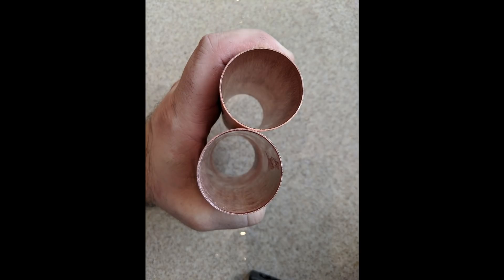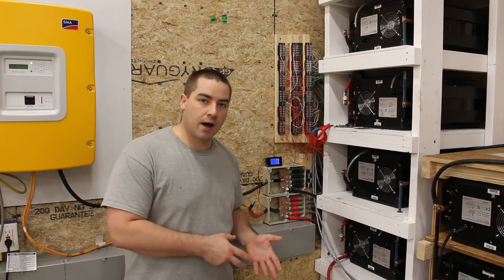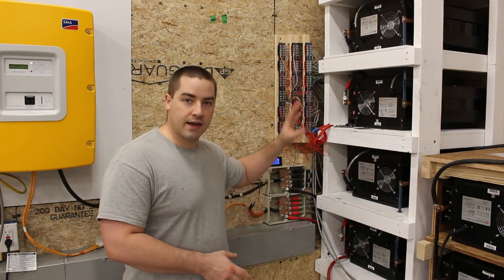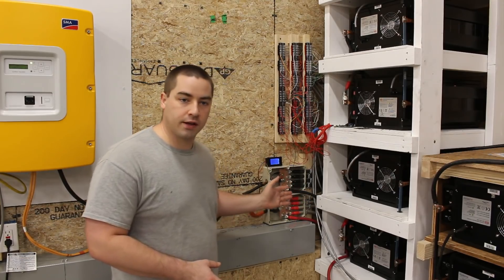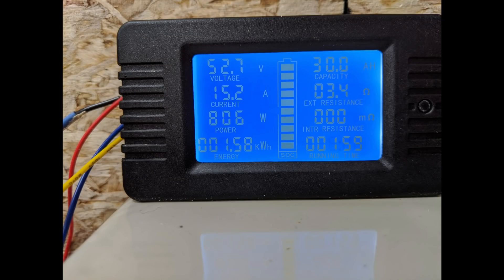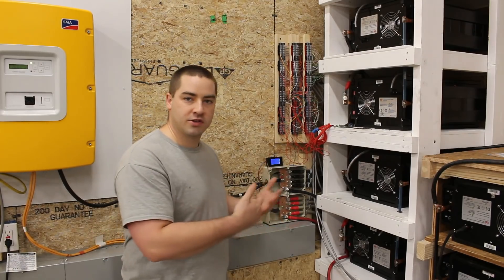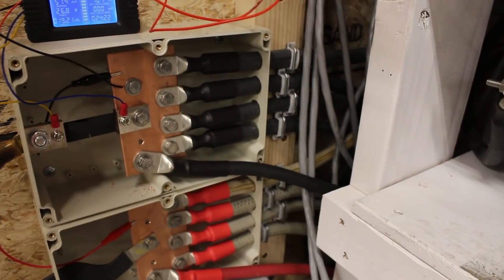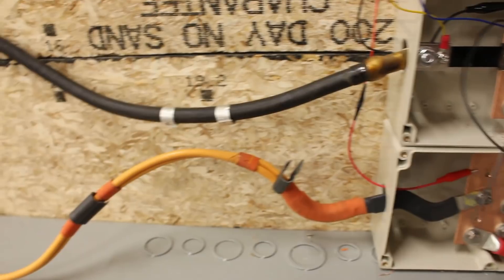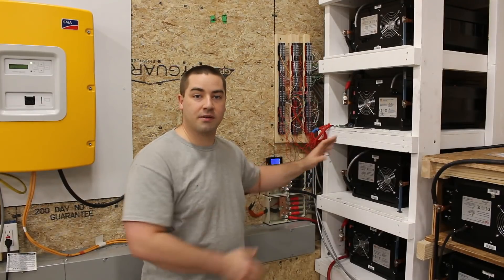I then flattened the pipe and drilled my holes. It is a little thin, so I ordered a thicker piece of copper, but this will do fine for low-amperage battery testing and I can swap it out later. After the bus bar I added a 100-amp shunt with a little watt meter. This is temporary, just for the purpose of doing some discharge testing on the batteries. I also have cables going to the inverter temporarily, just to get everything up and running to start conditioning the batteries.